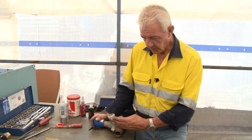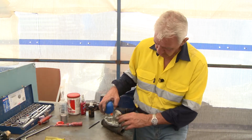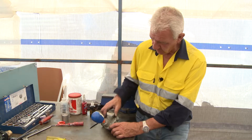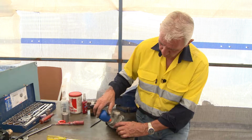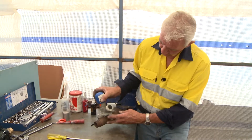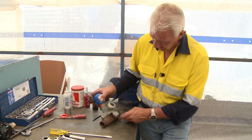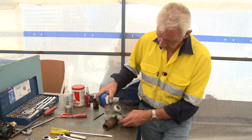What coincides with the combo valve is this micro valve. This micro valve adjusts the amount of grit that falls out of the conical section of the pot and into this particular hole here. On the other end of this blue knob is a piston. This particular hardened shaft connects to the pusher line which comes in one end, and the blast hose is on the other end.